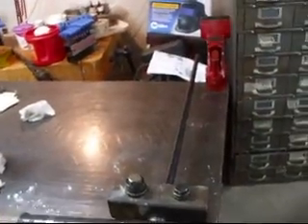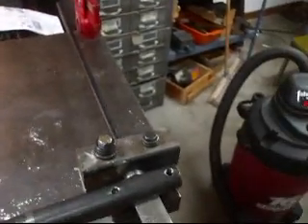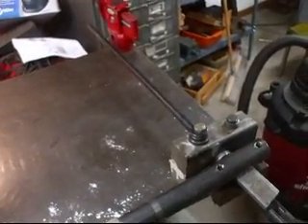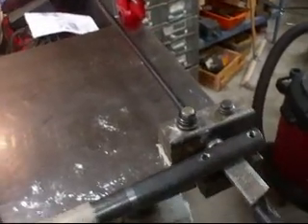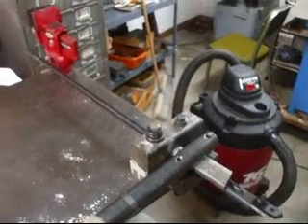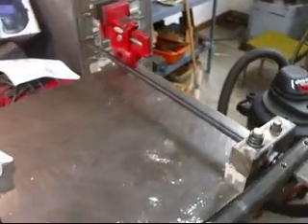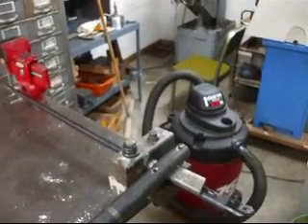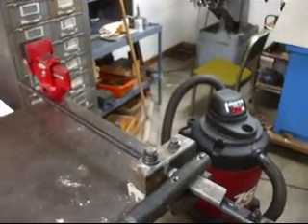I cleaned it with alcohol and a toothbrush and put motor oil on it, wiped off all the dirt. And it takes about 200 foot-pounds to get it back to the marks — the original Russian marks from '37 — and about 200 foot-pounds again to get it off that spot. So once we clean it, it goes down from 540 foot-pounds to about 200 foot-pounds. And it's about 27 degrees from where it locks up tight with fingers until it lines up the marks again.